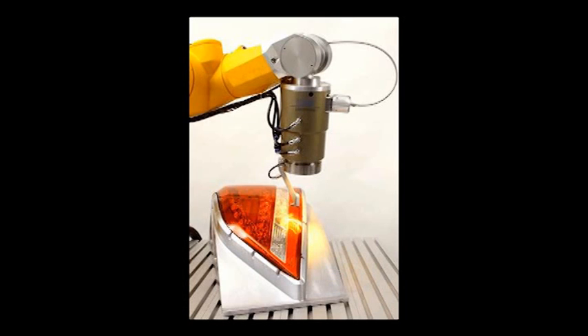Number two would be the use of fixturing. With the twin weld system we only use a bottom nest to hold the lamp. With our roller system, we're able to do full 3D forms with only the bottom nest, as our clamping roller applies the clamping pressure from the upper side, directly from the robotic arm. The next advantage would be joint cleanliness — we're able to avoid stringing issues that happen in other methods, and further achieve a reduction of mechanical stress. We're able to conform to any mold tolerance issues or differences from the housing to the lens, absorbing those tolerances and forming the lens to the housing.